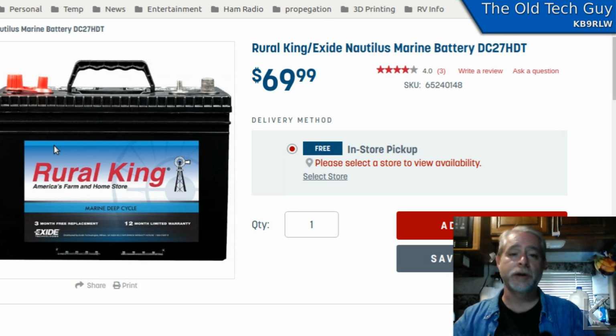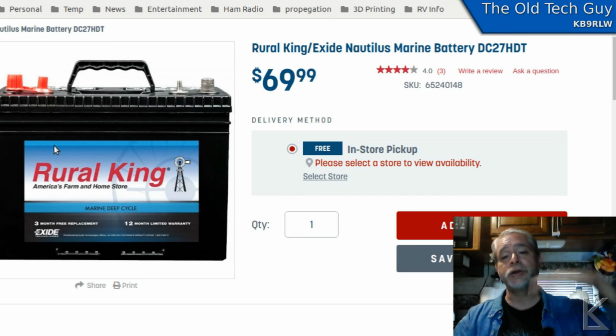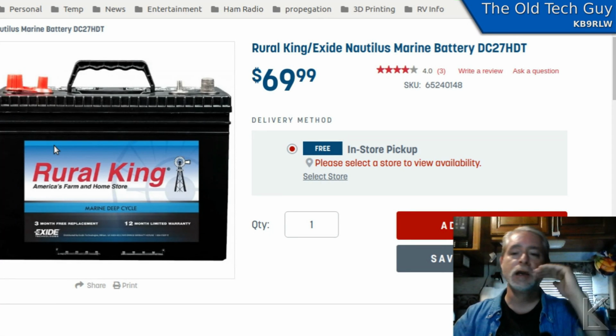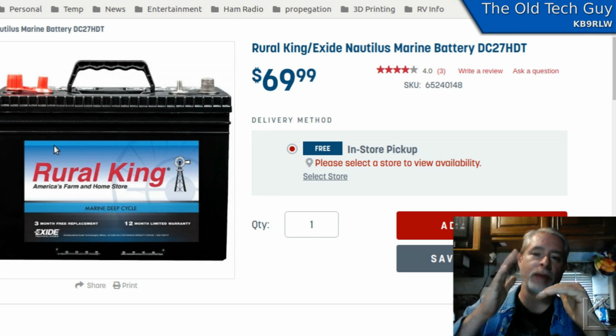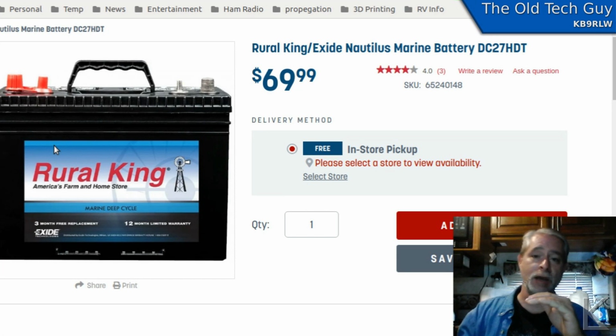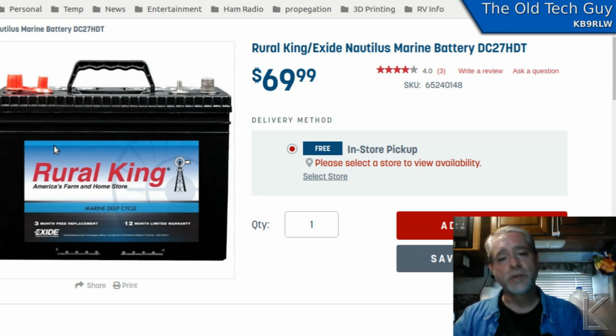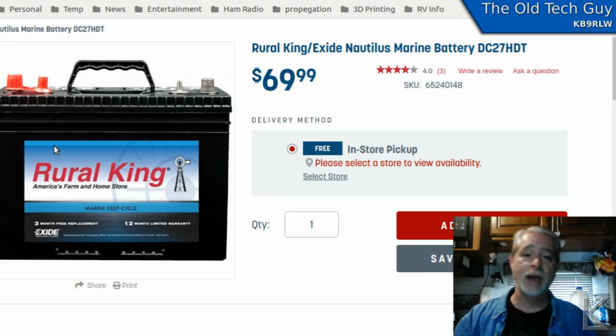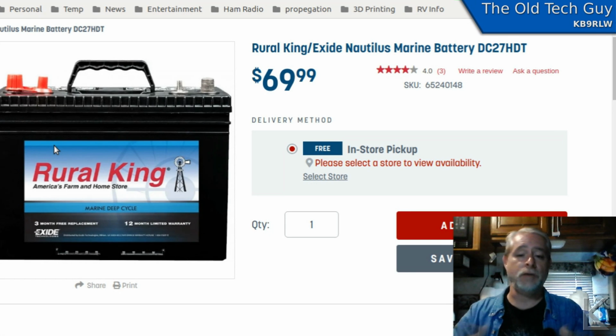The way a solar charge controller works is it will dump the full current of your solar panels into a battery as it's charging it. Once the battery reaches a charged state, the charge controller will back off and just maintain a float voltage, usually about 13.7 volts. So it takes just enough energy from your solar panels to maintain that battery voltage. And any other energy that your panels are generating is just not being utilized. And that's how it was. I could draw those batteries way down to where they needed to be charged, and the next day, if it was a sunny day, within 2 hours they were charged up, and the rest of the sun that I was capturing wasn't being utilized. It wasn't going anywhere. So I needed a bigger bucket.